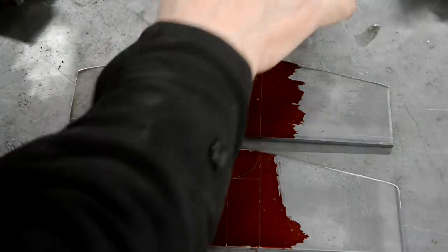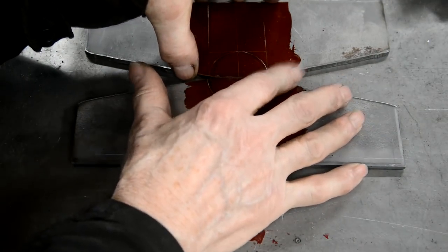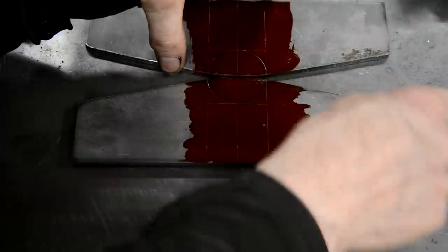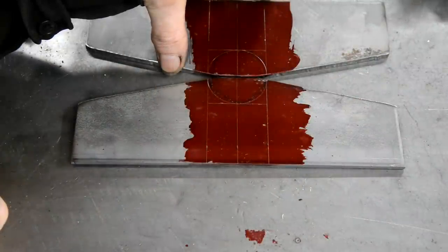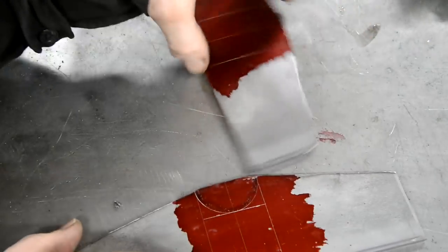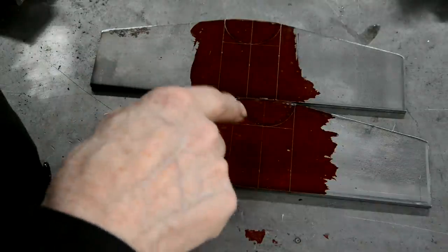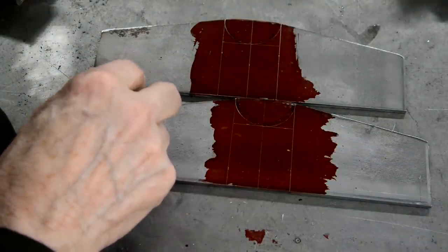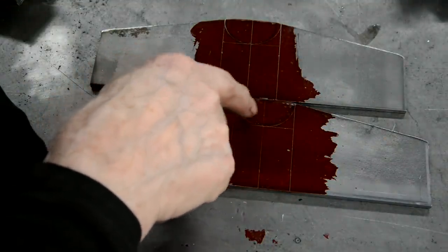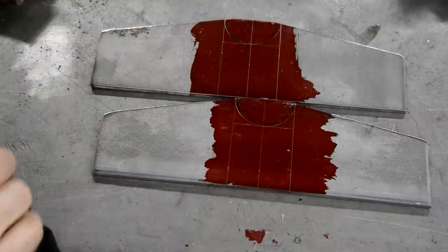I had thought, first off, that I might use the hole saw to do the hole first and then cut it. But I wasn't sure how that would work out with having the gap from the actual cut when you're using a torch, scarf, something like that. Anyway, I did them this way. So what I think I'm going to do is put a cutting disc. Oh, I know what I'll do. I'll do what the fella that builds the bicycles that people keep mentioning to me. I've watched some of his videos. A lot of the times when he has something like that, he actually just drills lots of holes and then thumps it out with a hammer and then cleans it up. So that's what I'll do.